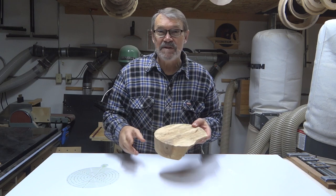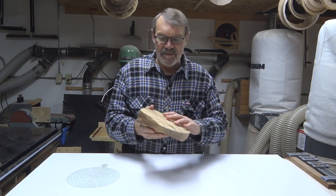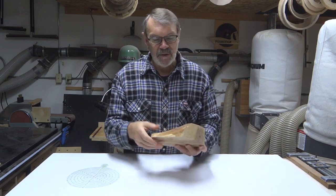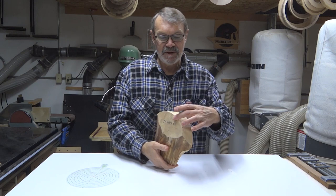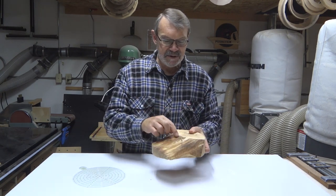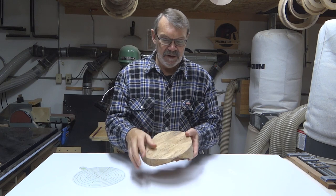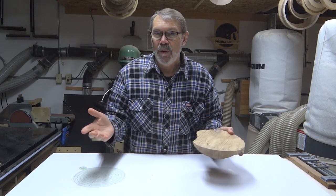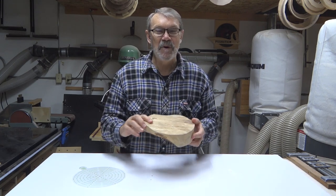I have a piece of maple that's been sitting around my shop for years. I have no idea where I got it or when. It's got a bit of a strange shape — not round or even close to round. It tapers from practically nothing to about two inches on one side. I'll use my smaller center finder to find the approximate center on both sides. I'm going to put it between centers, try to put a recess or tenon on one side, shape it, and then work on what's going to be the inside of a bowl or platter.